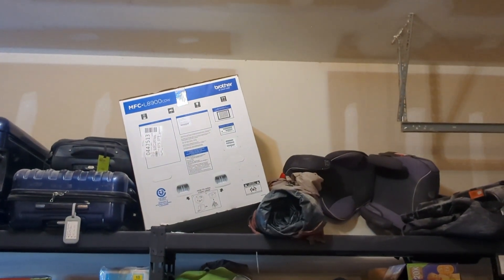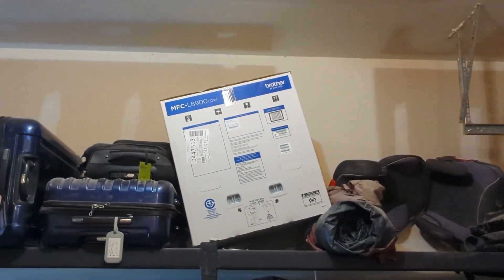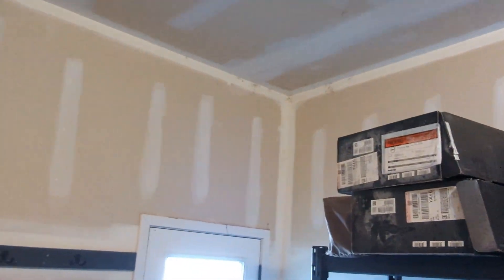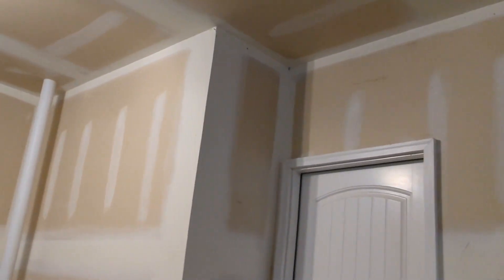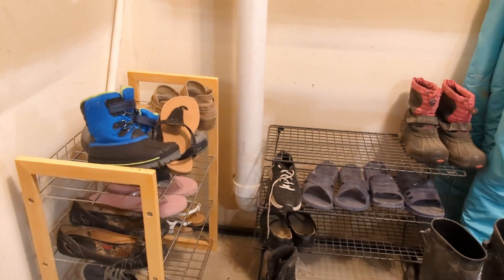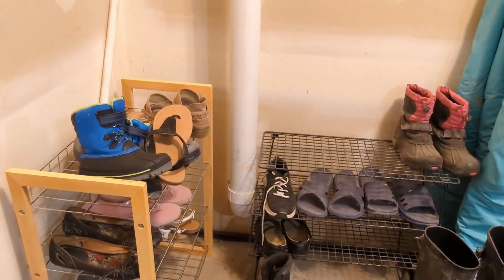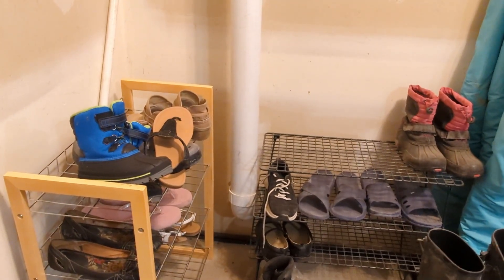Once we come through the wall in the white space area where several pieces of drywall come together, we're going to go around the top of the wall inside the garage using the clips that Starlink provides to hold up the cable. This will keep it out of the way of kids, pets, and anything we might install later. Our planning includes a long cable to make sure we have the full height and length needed to reach this wall. This white pipe is the radon exhaust pipe, which has a penetration through the wall into the utility room. We'll need a longer drill bit and a strategy to make sure the cable with its connector can go all the way through the wall.